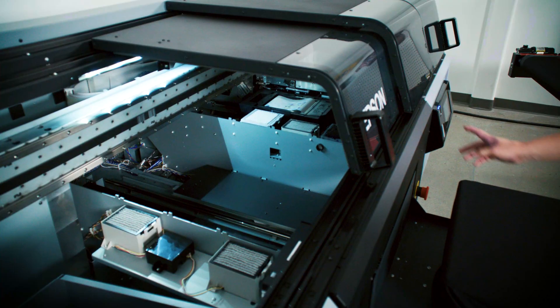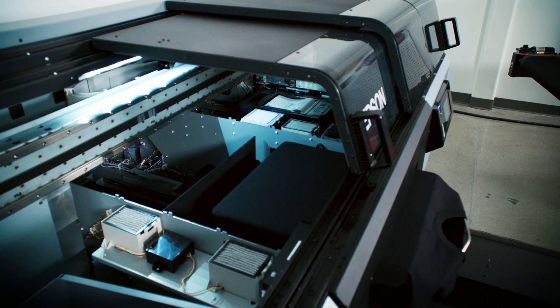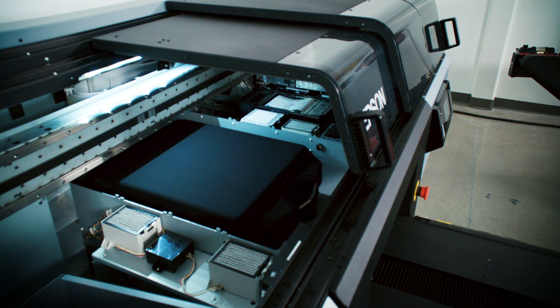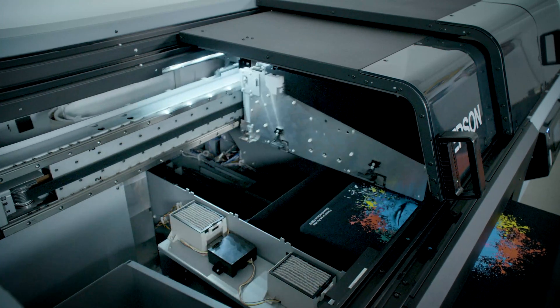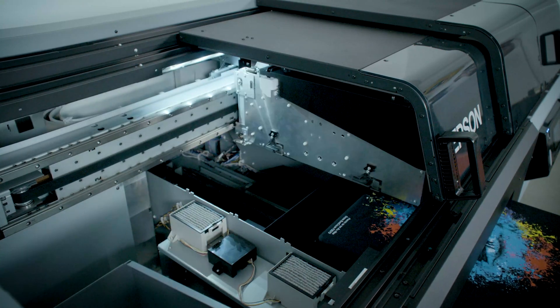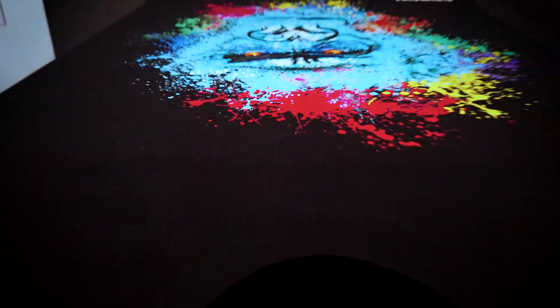While the garment is loading in — once we press that start button, the garment's loading, we're measuring the thickness, the data is streaming to the printer — the printer can also run any pre-job setups, like early flushing routines for a print head or size checking. All that's done concurrently to maximize the amount of time printing and minimize the amount of time waiting.